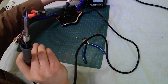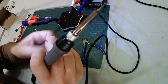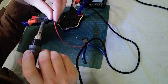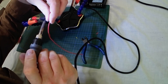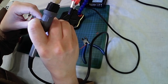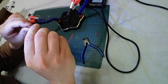Very quick — I am trembling too much there, but the temperature is not enough. It's also very difficult to work in front of the camera. Very quick — I just need to re-hit the tin on the wire, and in just some seconds it will be done. Checking if it is correctly soldered — yes it is. Three seconds max of heat, with the tin already on the wire.